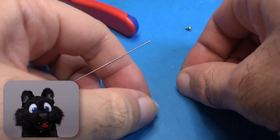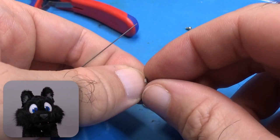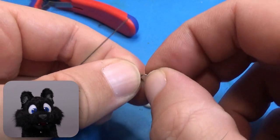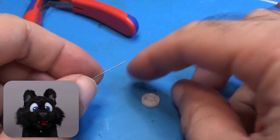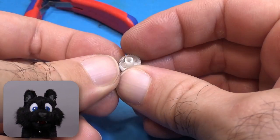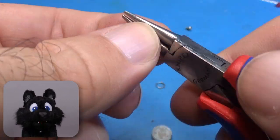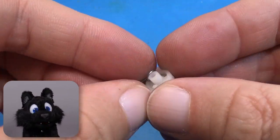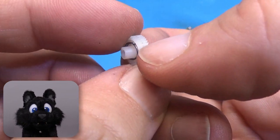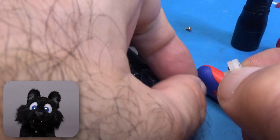I have loaded opposing gears to cut down on the backlash — nice idea! But the attachment point of the spring has broken off, so the spring is useless by now. I bent the replacement and glued the end of it to one gear so it wouldn't come loose. Not perfect, but serviceable.